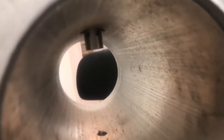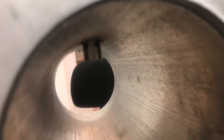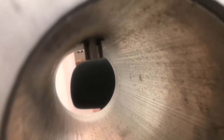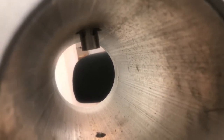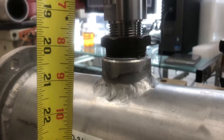If we look inside — which you can't do in the field — you can see that the holes in the sensor tip are flush with the inner wall of the pipe. That's exactly ideal: how you want the sensor to sit in the product line so that the fuel can flow through those little holes, and the sensor tip is not completely across the product line so that anything flowing through doesn't accidentally knock the sensor tip off. That's exactly how you install it — measure before and then install it to meet that measurement.